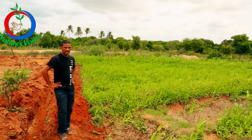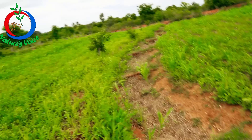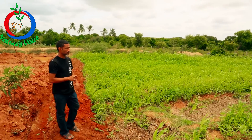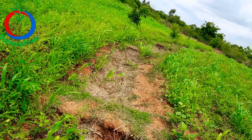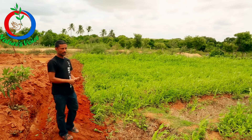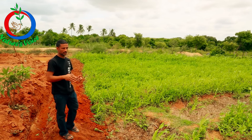As you can see, the land that we have is sloping towards north and it's also sloping towards the east. We have close to about 12 degrees slope in our land. Whenever you have a slope that is less than 20 degrees, you can do contour trenches, you can do swales, you can make beds which are parallel to the contours to conserve water and to stop the flow of topsoil and various other benefits.